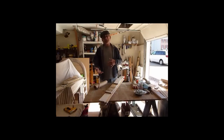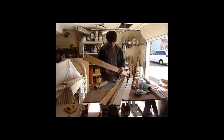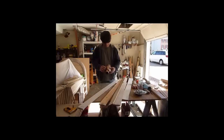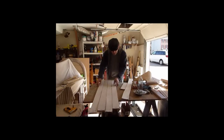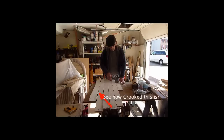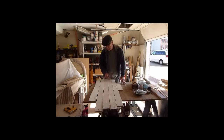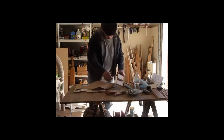What I have done is I've taken my pallet wood, cut the pallet wood off the two-by-fours, and I have pieces now. All the pieces are about the same thickness — they still have the nails in them. One of the things I found with pallet wood is sometimes you have to trim the edges so that they fit together well; some of them have gotten crooked as they sat in the pallet. So I'm going to run these through my table saw to just even up the edges a little bit, and then I'll put it back together. Now I'm going to lay these out and trace the fish.